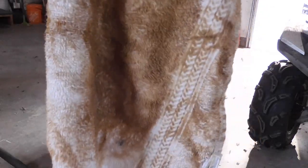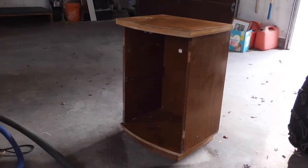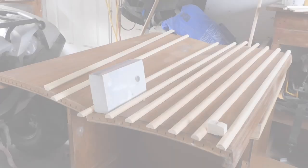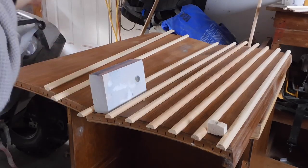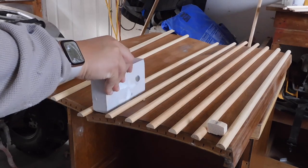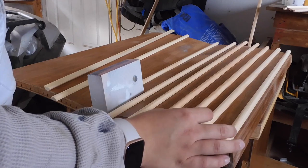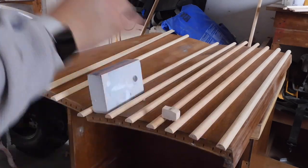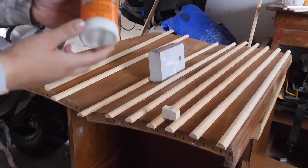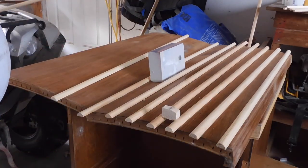This is why it's so important to clean your pieces. I'm just going to take a damp cloth with some water and give it another wipe to remove any chemicals or residue. I have my design laid out, and I'm going to start gluing down my pieces. I'll be using some scrap wood as dividers to make sure the design is even for each drawer and the spacing between each piece. I'm just going to be using some Gorilla wood glue to glue these down.